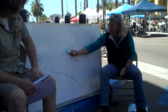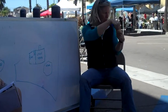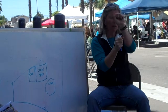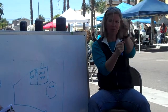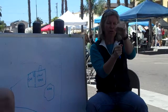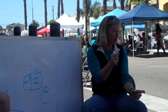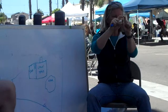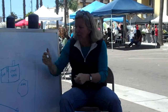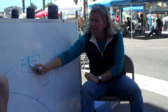All right. So this sounds like a possibility. Actually, first of all, that little opening that it hooks over. Yeah, right. First thing we're going to do is take that corrugated hose. We're going to stand it up, and we'll put a three-way valve onto that. So now we're going to have a valve, and we're going to have the option of garden, sewer. And so when we say sewer, we'll have a separate pipe, and that pipe will continue and go down the pipe that you have now, where it's going. And then we're going to give it the opportunity to go through the new pipe, and we'll go down the wall. And it sounds like what is possible is to go through the back of this wall, and then we'll be in the crawl space. Is that right?